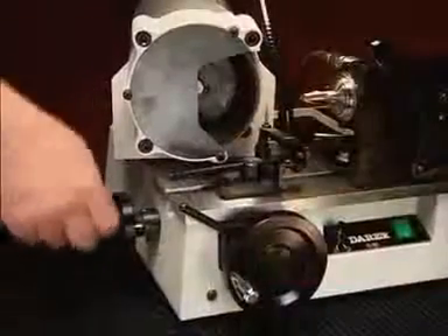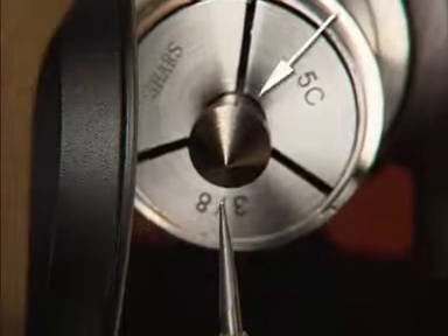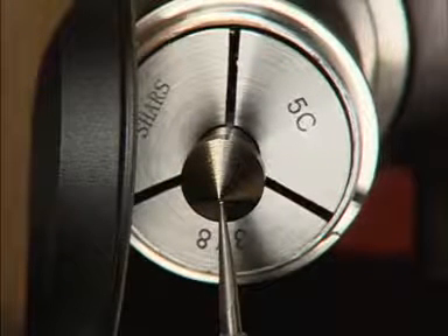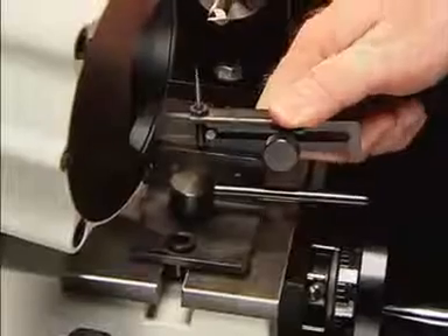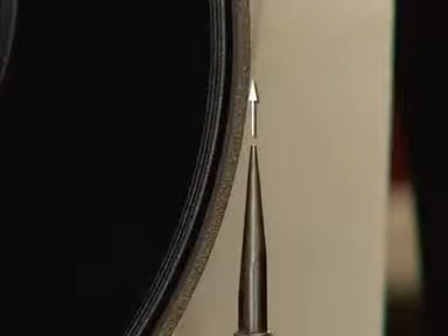Next, move the wheel to the neutral position by rotating the cross feed knob until the solid white line is in line with the grit cover and positioned at zero. With the wheel set in the neutral position, you will need to verify and/or set the height of the stylus. Start by inserting the height setting pin in the 3/8 inch 5C collet. In the primary position, slide the stylus toward the height setting pin. Loosen the stylus lock nut and adjust the stylus until the tip touches the bottom of the flat area at the tip of the height setting pin. Tighten the lock nut. Note that if you accidentally grind the stylus at any time, you should immediately reset the stylus height, as this setting affects the amount of relief ground onto the endmill. Finally, set the position of the stylus fixture. Release the locking lever and slide the entire stylus fixture so that the stylus is in line with the most outer periphery of the grinding wheel. Your Derex is now set up for sharpening.